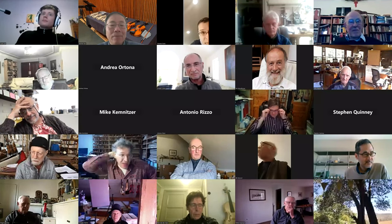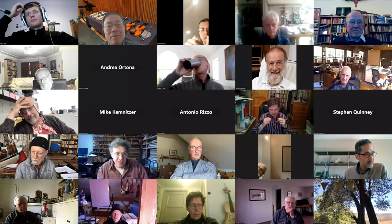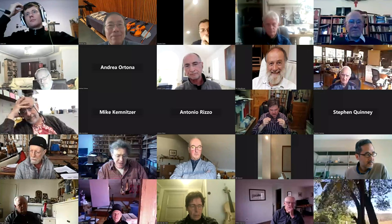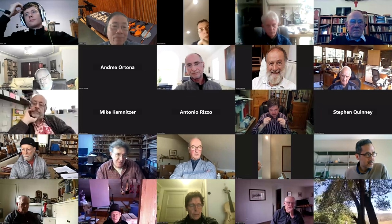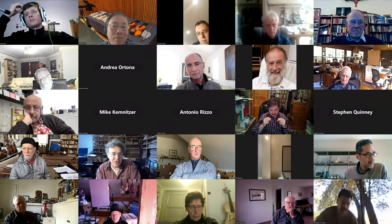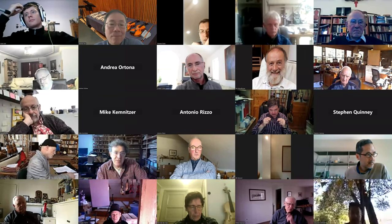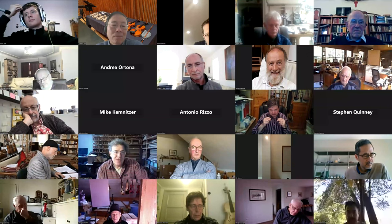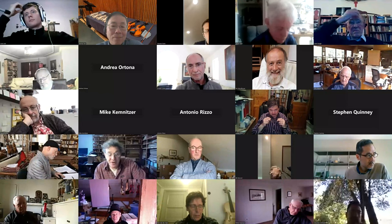A lot of great things have been covered, so I'm not going to recover them so much. Andrew's talk about materials, I think, was very on track. The link between arching and materials and model choice is very, very interesting. I don't know if we totally got into that, but for a quick example, probably the two main models that I build in my workshop are Guarneri models and late strads. Late strads tend to be high arched, and the originals that I modeled them after were quite thin. So that works very well with rather harder wood, because you want to go thinner on harder wood because it's heavier. And that works out because you have a model that wants to be thinner anyway.